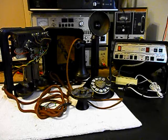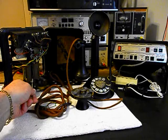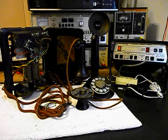We also want to go through our network, our wiring block. There's an issue with the clapper on the solenoid. The clapper is kind of locked up. It's not moving back and forth. And there's an issue there. We're going to have to go through that. So we need to go through everything on this telephone and bell box.